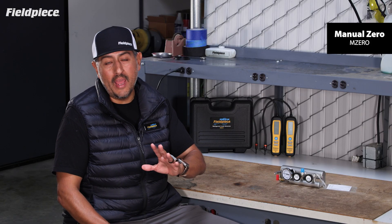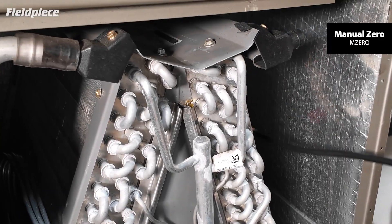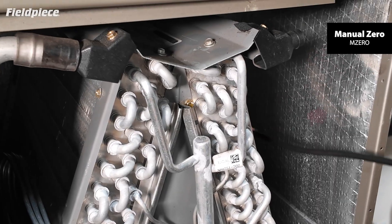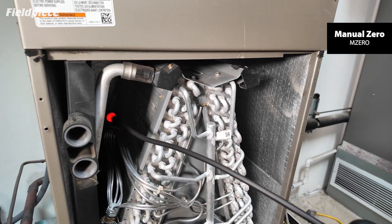The one downside to that type of behavior is if I'm looking for a leak in a contaminated environment — for example, at the evaporator coil. When I pull off that panel, more than likely that entire space is filled with refrigerant gas. So when I stick in the leak detector, it'll beep and go off everywhere because it's just refrigerant everywhere.